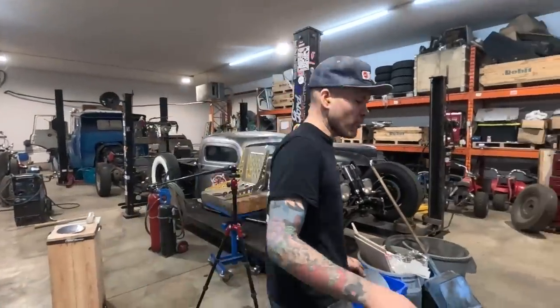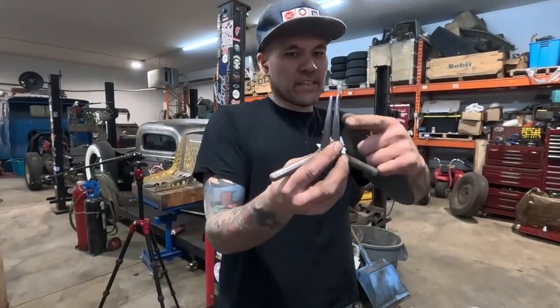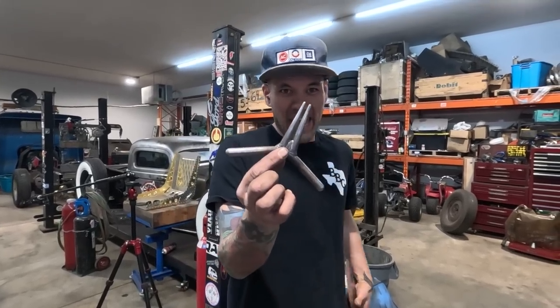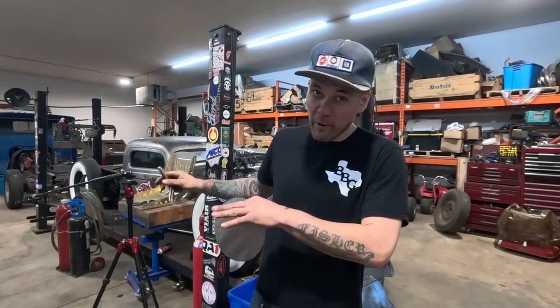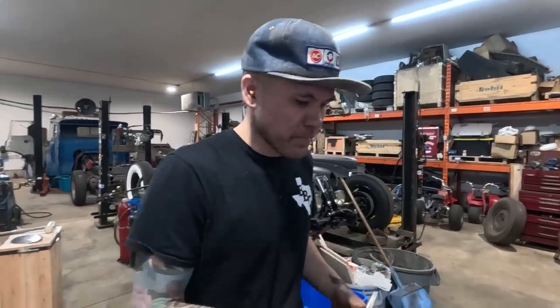Next up is the tucking fork. I did do a video on building one of these. They're very simple. All it is is a couple of tapered pieces of round bar made onto a little handle. Basically, what I'm doing is deliberately putting in tucks with the fork, and then we're going to hammer them out without a bowl. This is another technique completely separate from a shrinking stump, another way you can shrink metal.